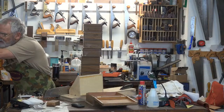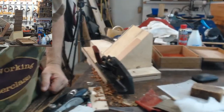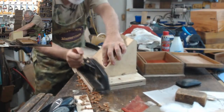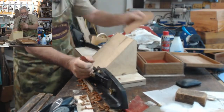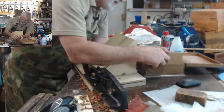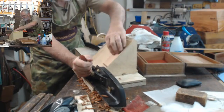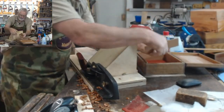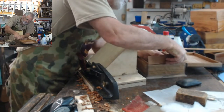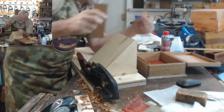Yeah, but the picture frame guillotine, when I'm using really thin stuff like I'm using now, it gives me too much tear out, and for what I'm doing really, the only answer is exactly what I'm doing here. And it takes a bit of time, but sometimes it can save a bit of time too, because you can get it accurately, whereas if I went over to say the table saw, I could take too much off and then I'm too far gone. And if I take too much off doing it this way, too much isn't very much, if that makes sense.